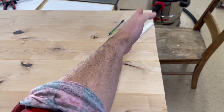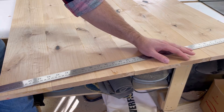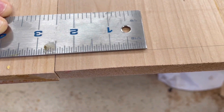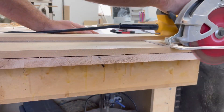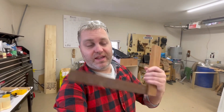Now I know math is hard for people, but all you have to remember is draw a circle. These two points line through the diameter. This will be a 90 degree angle down here. There you go. And in case you don't believe me — there we go. A square corner with a stick and a straight edge.